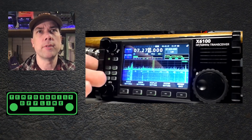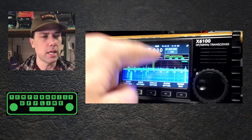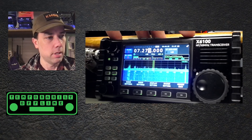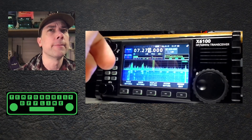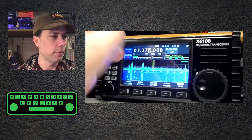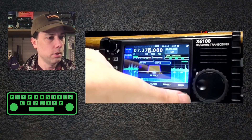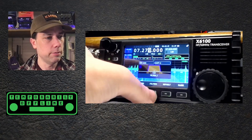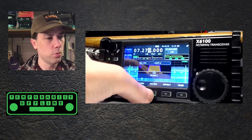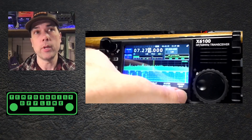The AGC mode indication string has been simplified and changed to AGC, AFS, and dash-dash. Right here it says AGC dash-dash. We'll hit the AGC button: AGC, S, F, A, dash-dash. Yep, that works. They've also added the current filter bank indication string FIL X below the VFO frequency — it says FIL 1 there. Filter 2 close — it says filter 2. Filter 3 close — it says filter 3. It changes one, two, three. You don't have to hit close.